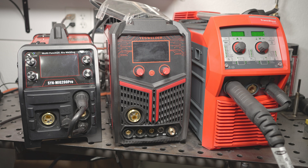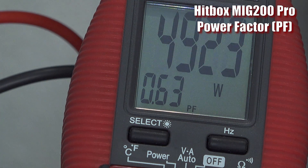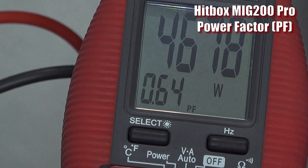Maybe it would reliably hit that amperage as long as you didn't also max out the voltage. But either way, it does run smooth with the maxed out settings, and turned down just a bit, I never had it cut out. So it'll put out around 4,400 watts on 240 volts without issue, and it will hit nearly 4,700 watts, though mine has cut out a few times when running at that high level. Power factor is around 0.65, which is pretty bad, but it's also fairly typical for an inverter welder without any correction.